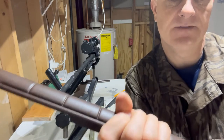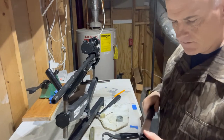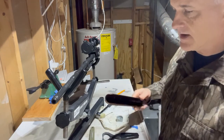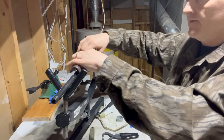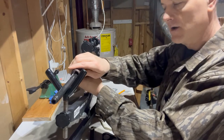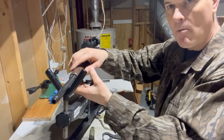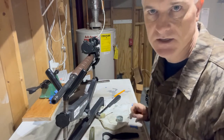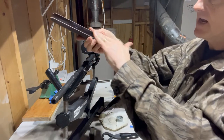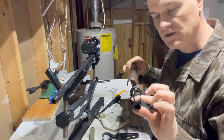I tried to relieve it a little bit so it'd be super tight. I'll take a look after it all goes together, because I don't want it to be fixed to the rear and have it lean towards one side or the other and be all uneven, because then I have to relieve one side more than the other again so that it doesn't touch the wood stock. So I'm just trying to preserve the straight edge here and aim it squarely with respect to the gas cylinder.